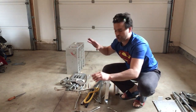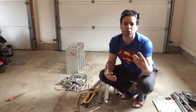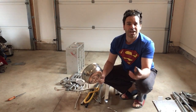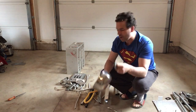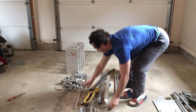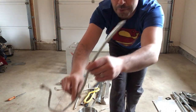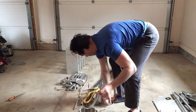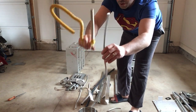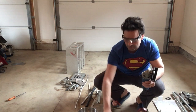The next test to make sure that an item is not stainless steel or aluminum is the spark test. Using a grinder - if I touch these items with a grinder, aluminum does not spark. Stainless steel, however, will spark. So that is rule number two: if non-magnetic, use the spark test. I'm just going to hit a couple of these items. Just putting some safety glasses on - I have my grinder right here.